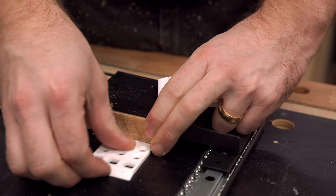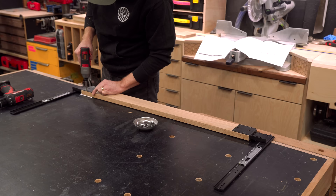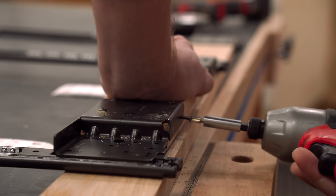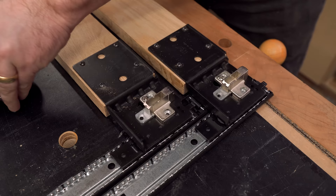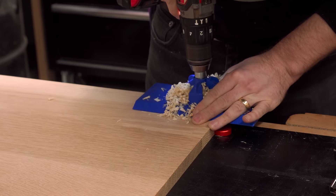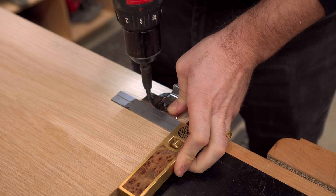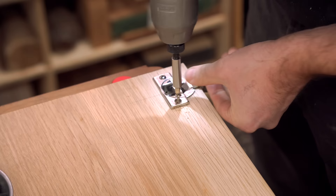I was starting to run out of things to do without the right size hardware, so I was really happy when it showed up. It's way easier to install this stuff a second time - the first time I saw this hardware I had no clue how it worked, so I'm really happy I built that mock-up. I built two assemblies - one long, one short - and both had a chunk of solid white oak in the center. With those taller clips installed in the pocket door hardware, I could start drilling out the door panels for the hinge hardware. I really like this drill guide for drilling out the hinges - I'll post a link below - but I always just use my combination square for the screw holes and it's always worked well for me.